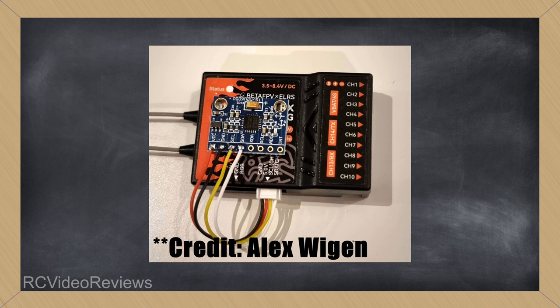And the SCL and SDA are straight through wires. You don't cross them over like we do with UART wiring. It's a straight connection. So if it says SCL on the gyro, you wire to SCL on the receiver, okay? And then SDA on the gyro goes to SDA on the receiver. It's that simple. So very simple wiring diagram. This shows you how to do it on the Beta FPV 14 channel,